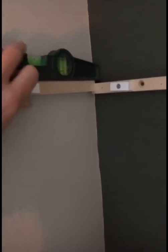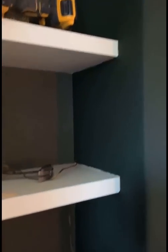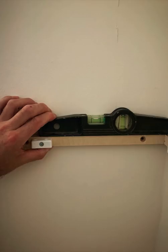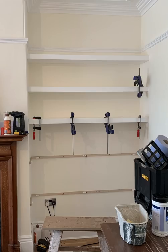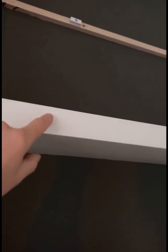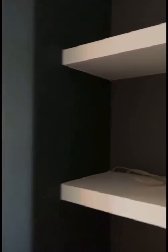I'm talking a bit fast because I really need to get this job done — this is probably the most unprofitable job ever. I made the mistake of assuming when the customer rang up that we'd already standardized on 54-millimetre thick shelves. He sent me the photo, I thought I remembered it, sent me the alcove width, and I said we'd knock up our standard shelves. Turns out when I made these originally I hadn't yet standardized on the three-times-18-millimetre thickness we do now — I had a lip applied to an 18-mil board with a 6-mil board on top, so 42–44 mil thick shelves. We prepared all the parts as normal, brought them over before Christmas, and then realized it was all wrong. I had to take them back, trim the lip down, and correct the depth too. Lesson: don't assume.